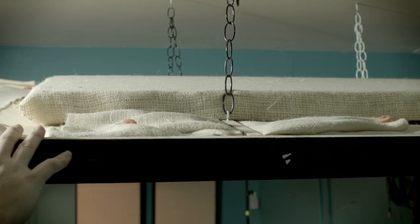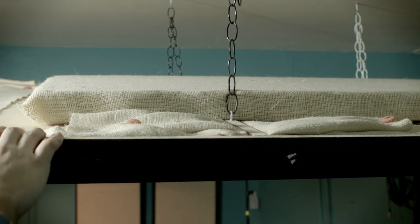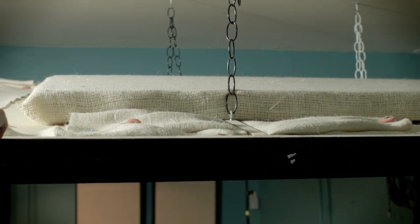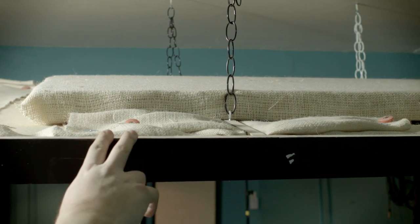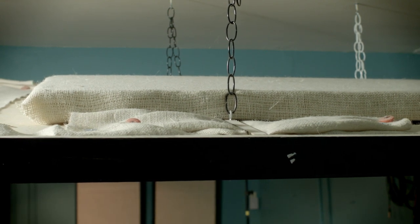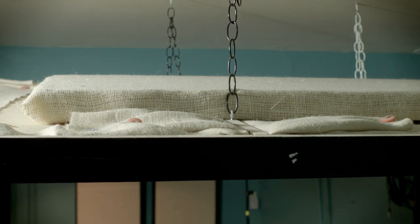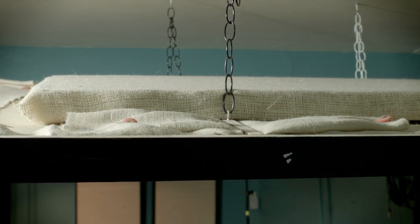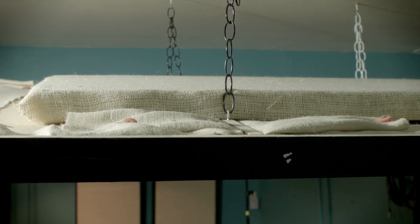But you can see, basically, I'm doing the same technique: wood frame, Owens Corning 703, shingle nails, or roofing nails. And then I've also added a piece of the 703, just laying it up there, to thicken the spots that I think need it the most to get some of the low end. Ideally, I would probably rebuild this panel and make it 6 inches thick.